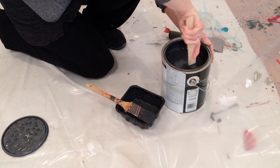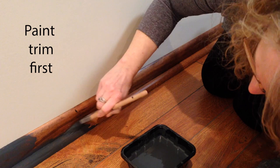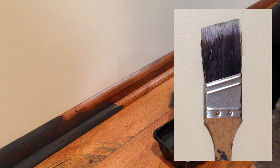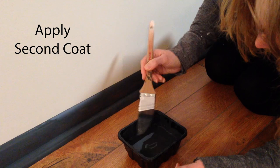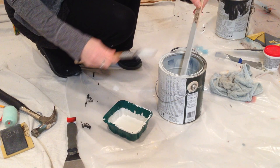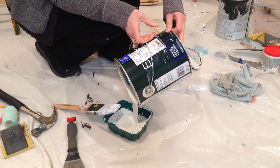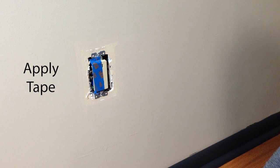I used to paint the walls first until a professional painter taught me to start with the trim. I also learned that it was worth the money to buy a good quality angled brush and high quality paint — the results are so much nicer and the experience of painting is more enjoyable. I'm going to let that second coat of trim dry for about four hours, and while it's drying, I'll do a little preliminary work on the walls — starting by removing the outlet covers and the switch plates, then covering the inner workings with a little bit of painter's tape to protect those against splashes.